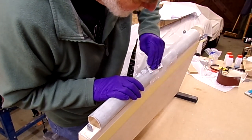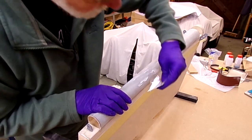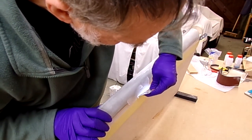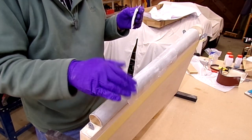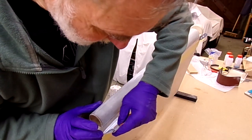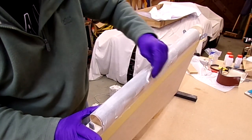I'll also do the edges where the fillets go, so in here where we get that transition going across where the plywood was tapered to allow for the skins, and everything else here was sort of tapered down to that, so we built up the fiberglass. But there'll be a small step there, so this should get rid of that step, so that once it's painted it will not be visible at all.